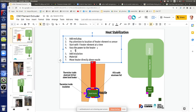The set point temperature. Well, what does the power of the heater determine? Does it determine the max temperature? Not really. They both can get very hot. It does determine how fast you're getting to that. If you blow through with high power, you reach the max temperature quickly. If it's higher power, you'd potentially be burning the stuff faster, naturally. If it's lower power, then it might just have marginal power even to burn anything as it's flowing through. I think these are like 200 watts or so. They can get to 500 degrees Celsius in 2 minutes.